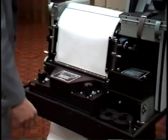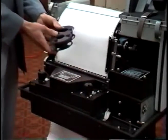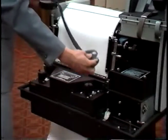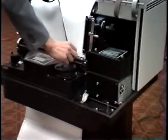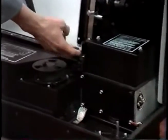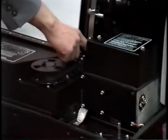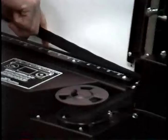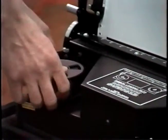As I told you in training, there will probably be a ribbon located inside the printer. Take the ribbon out, unroll it, insert the ribbon on one spool while holding the other spool in the other hand, and carefully guide the ribbon around the guideposts and on this side of the foil, and around the guideposts over on this side, and onto the other spool.